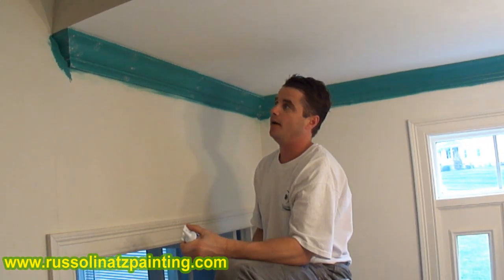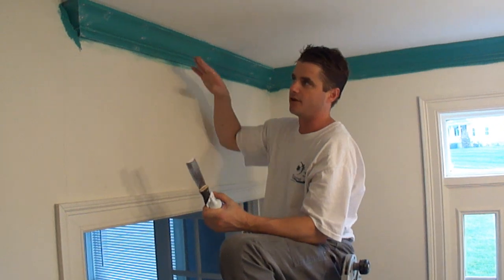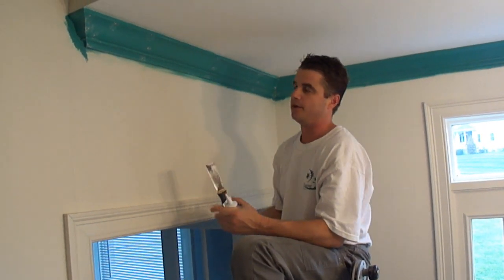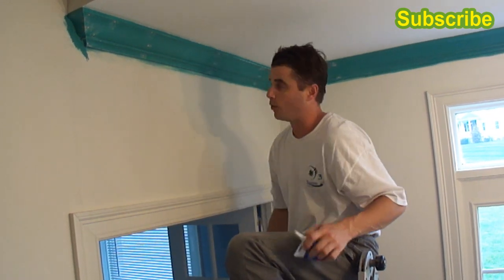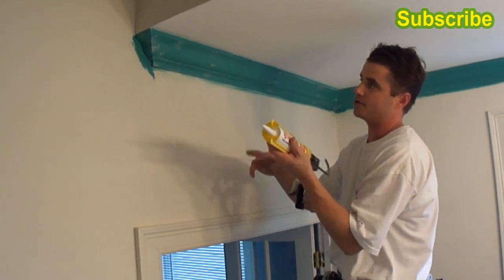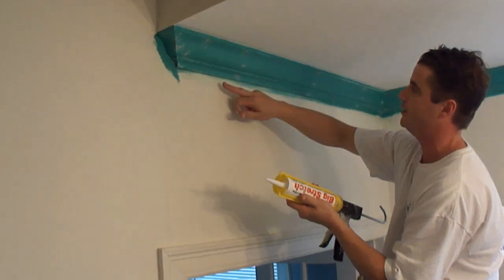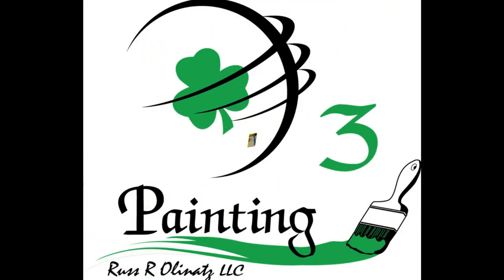This is going to shrink, but when it dries, you just give it a light wipe — not a tough sand, just a light wipe — and then you're ready to fill the holes again. So now what we're going to do is use this caulk on here to caulk both sides, the top, and the bottom. I'm using a caulk called Big Stretch.